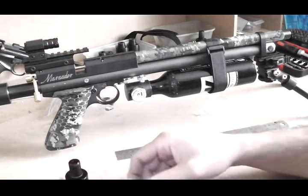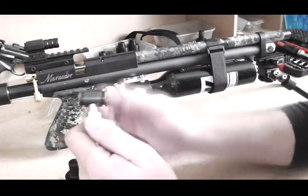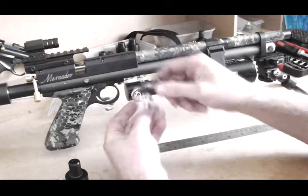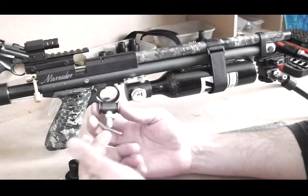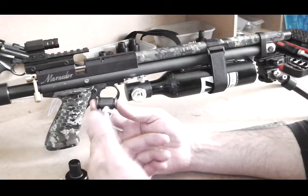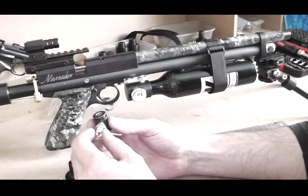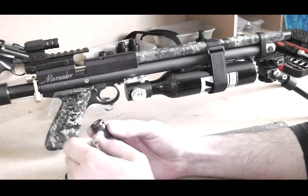Inside your main tube you will have a gauge port — this is one here. The gauge port adapter screws into a 1/8 BSP parallel pipe thread. On a standard gun, the gauge screws into the bottom section, but the gauge uses 1/8 NPT — BSP is a parallel thread at 28 threads per inch, NPT is a tapered thread at 27 threads per inch. This difference doesn't affect us because we just want the 1/8 BSP side which is already there.